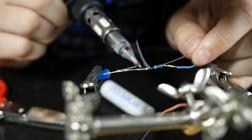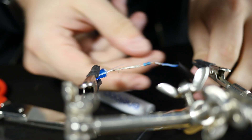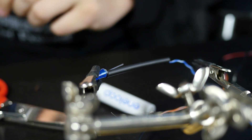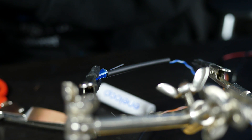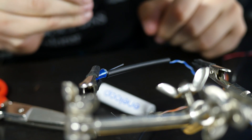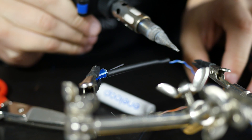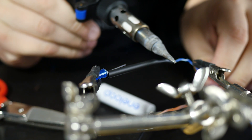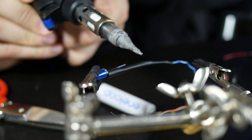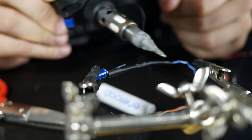With the striped wires, peel back the sheathing and solder the exposed copper to the resistor, then the resistor to the anode side of the LED. Remember to put the heat shrink tubing on first before you solder. Then use the heat shrink tubing to act as sheathing for the entire length of the anode — you could have cut this shorter, but in my demonstration here I did not.